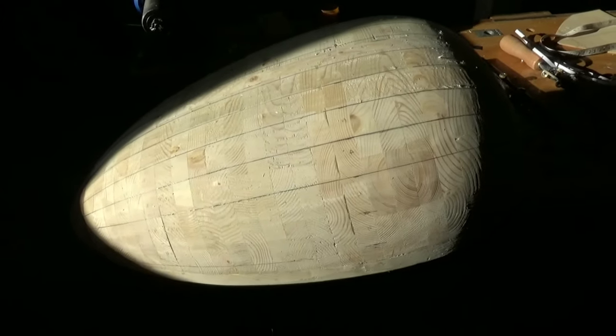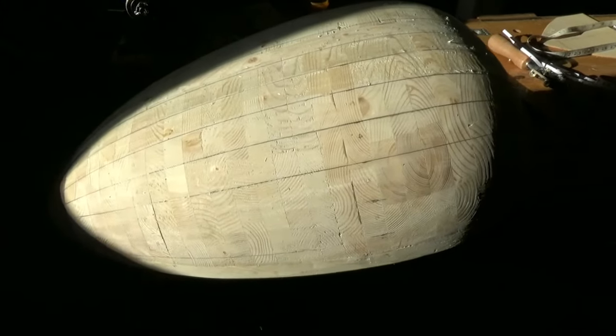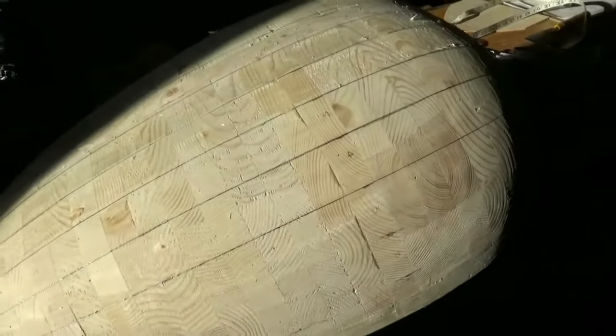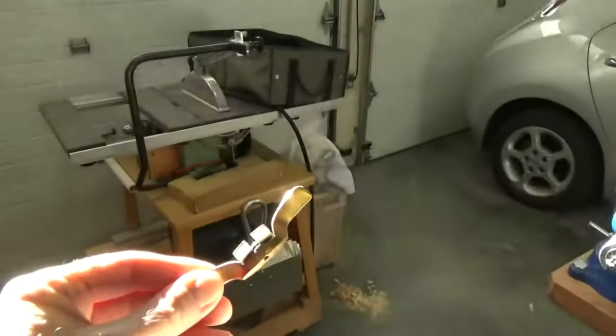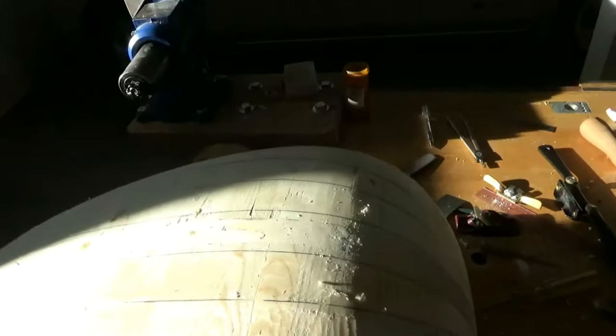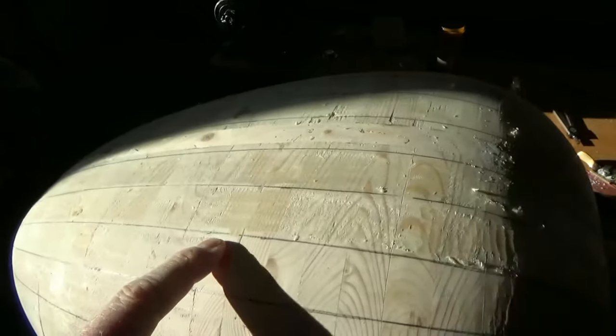You can see that it's almost finished. I've got all the sections in place. I have a little nose cone part where the ribs go - that's the block right there. I'm just drawing on the lines for the ribs and then using a little tiny spokeshave here I'm going to be putting the flats on these ribs so that the wood won't stand away from the mold and I can join right on the edges here.